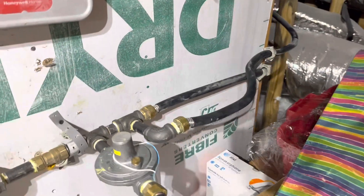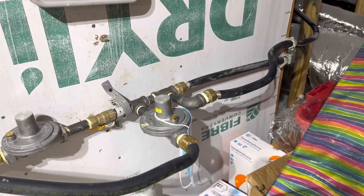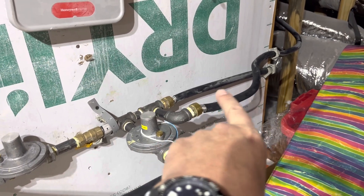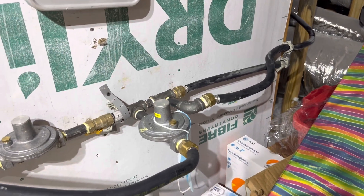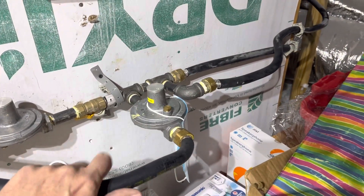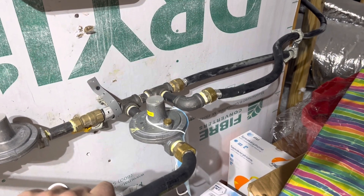12-month warranty inspection. The plumber's been out here four times and can't figure out what's wrong with the water heater. Half-inch main. Nowhere are you allowed to use a half-inch main to supply natural gas to your home. There is real value in having a licensed plumbing contractor who is also a licensed gas fitter do your home inspections.